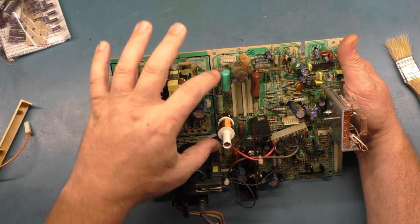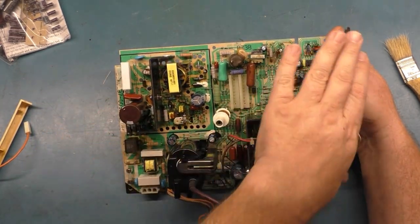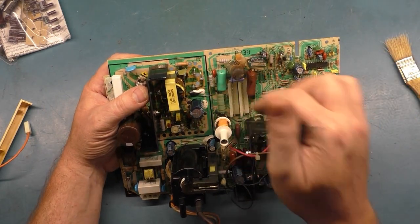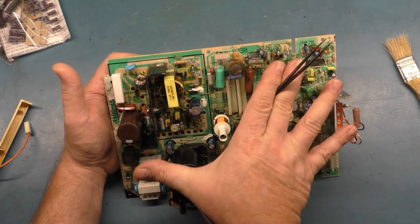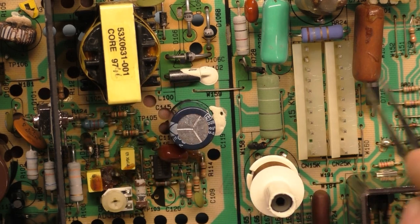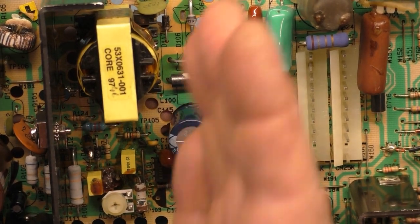But it's really important to isolate your power supply. See, there's this black line around here, this black square. This is your power supply. That's all this is. And then the rest of this whole area down here and then around here is the rest of the B-plus output section. So this is your main power supply. To isolate it, you lift up this leg of W159. The only thing that connects the power supply to the rest of the chassis is this jumper here, W159. That's the only thing. If you follow the black box, the only part that connects the black box to the rest is this little jumper right here. So you lift this jumper out of the circuit, and you can hook up your light bulb to this and verify it lights up and test your power supply.